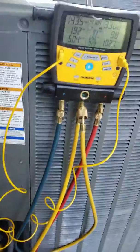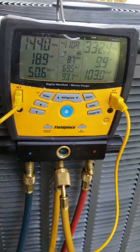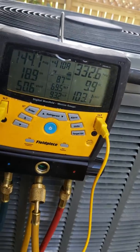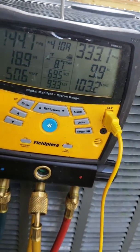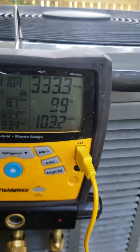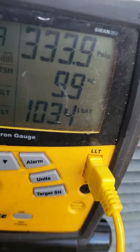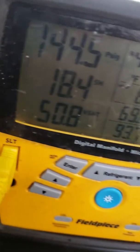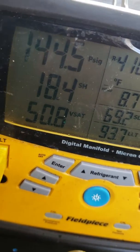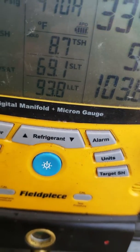Okay, so it's been 10 minutes later. I picked up all my tools and put the nitrogen away — that's the only thing I got is the drill and the gauges. 143, 144 over 332 — beautiful pressure. Inside's a little hot in the house, outside perfect pressure. We wanted to be at 8 sub cooling — it's at 9.8 which is great. Over 18.4 — could be better, but looks like it's in the range.